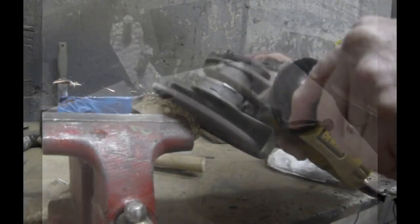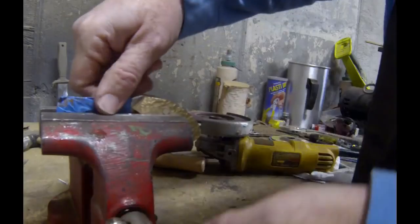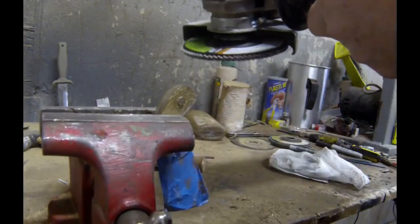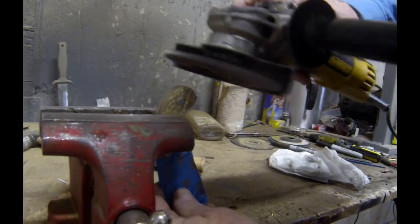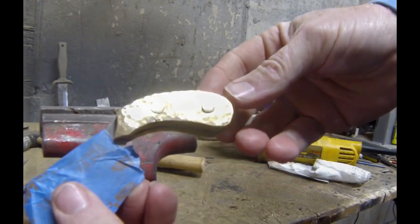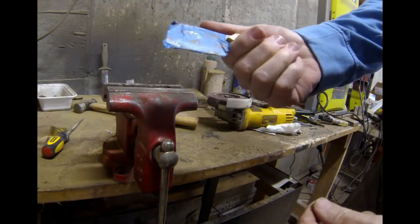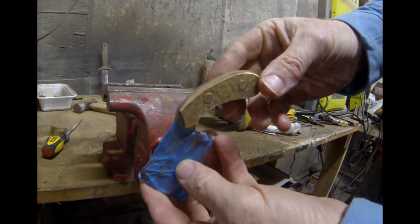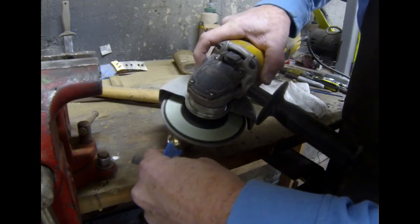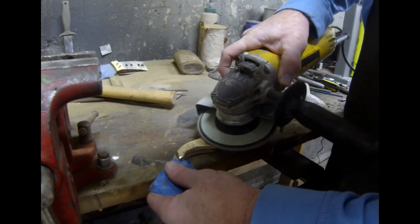I like the ball-peen look, but after finishing the scales into their final shape, they just weren't comfortable in my hand. I wanted to round over those scales like I do with wooden scales — make them more form-fitting into the palm of your hand, rounding over all of the edges. Before rounding, it really just wasn't comfortable. During the process of rounding over the scales, I ground away a good portion of each side. I did most of the rounding with a disc angle grinder, then sanded them all smooth, and also used a Dremel for some of the edges.